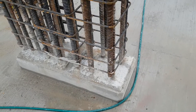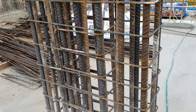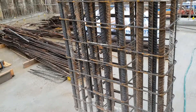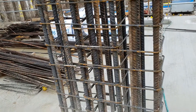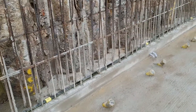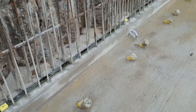That's the column — that's how it looks at the kicker. It's going to be scabbled a little bit more to make the surface rougher, to make a good connection between the fresh new concrete and the kicker pour. You can see each bar is spliced — you need to make sure after the pour, especially after pouring the kicker, there's enough splice. I'll cover this more in the construction drawing series about splices and all that.